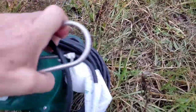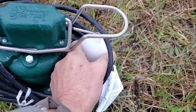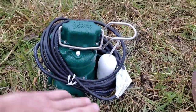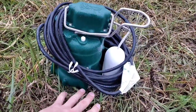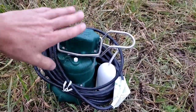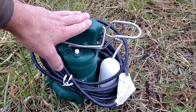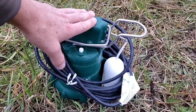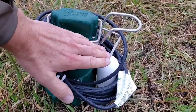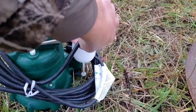All right, a sump pump system, the float goes up and up and up, and it has to go all the way to the top before it turns on. So by the time you put this in a housing, so it's sitting on the floor of a housing, and then you got the throw of this, half horse, we usually use a half horse outdoors, and for this full frame demonstration, we're using an M98. So there's 10.5 inches just from when this float turns off to when this float comes up and turns on.